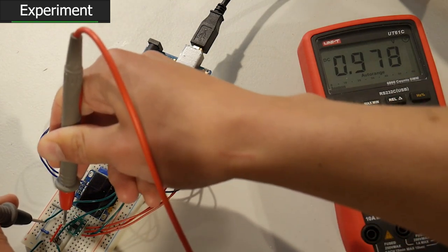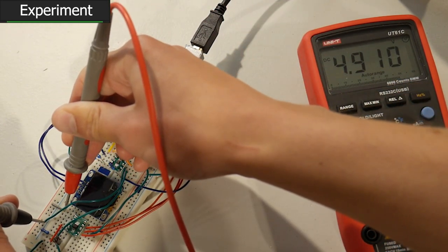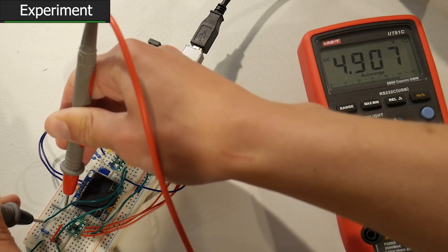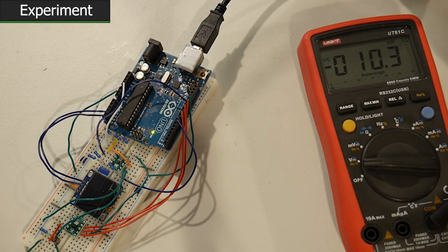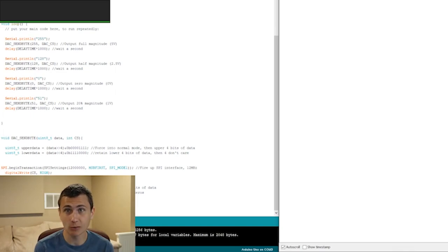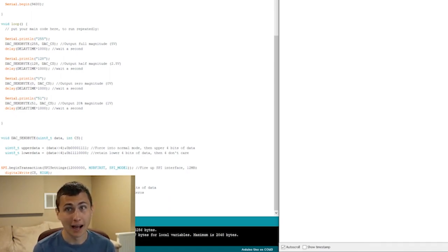What I'd expect to see is that VCC is just a little light. What are we seeing? 4.9 volts — good. If that were exactly five volts I'd be a little concerned, but it's not. So it looks like this system is functioning as expected. Looks like we've got a DAC driver. Soldering this part under the wrong footprint, putting it on a breadboard, and having no decoupling capacitors kind of, sort of worked. I'd never design a product this way or use this in the electronic load this way, but as a proof of concept we have proven that this SPI driver and this configuration of an SPI peripheral is correct.